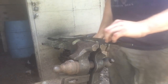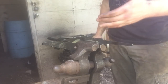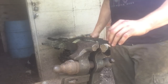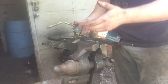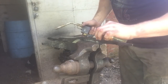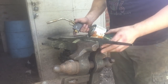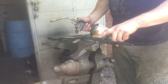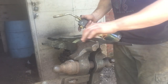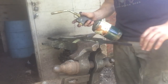Now it's time for a good old differential temper. If you're new to knife making and you don't know what tempering is — when a knife comes out of the quench it's very, very hard and very brittle. I could grab this and snap the end off if I wanted to right now. So you need to temper it back just a little bit to make it more ductile but still hold an edge. What I like to do is clamp the edge up in a vise — the vise acts as a heat sink to keep heat from creeping down into the edge. I'll temper the spine back to about blue so it's nice and springy, and temper the edge to a light straw color, so the knife is strong but will still hold an edge.